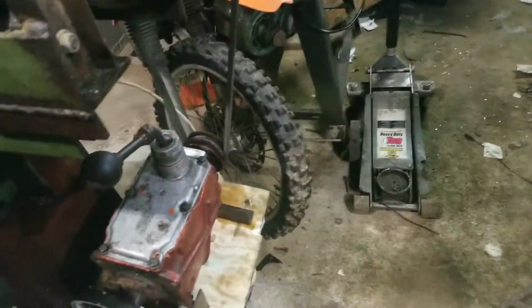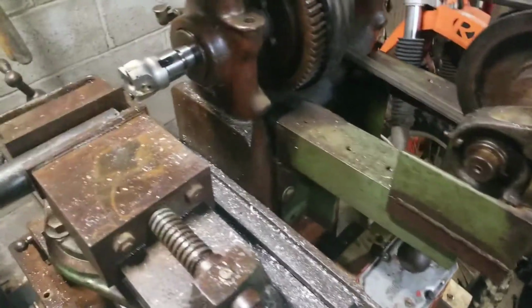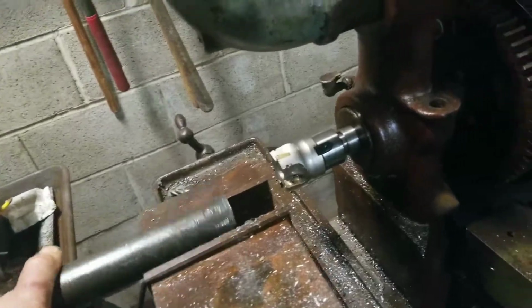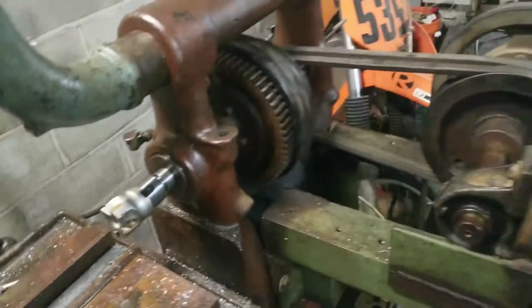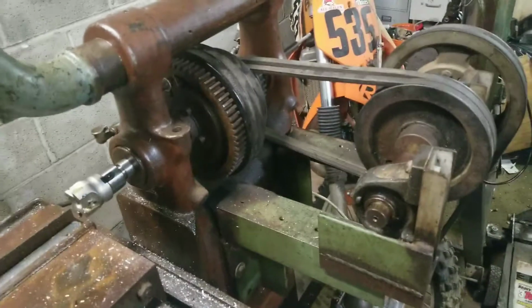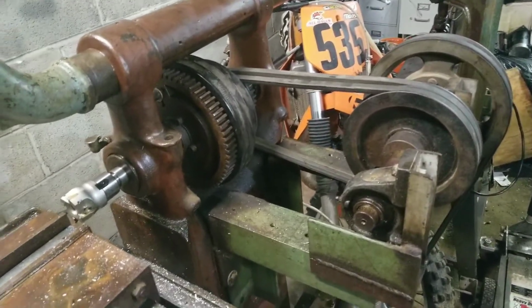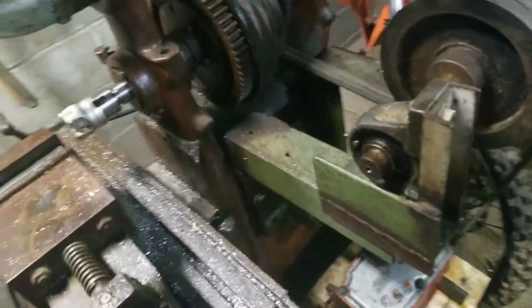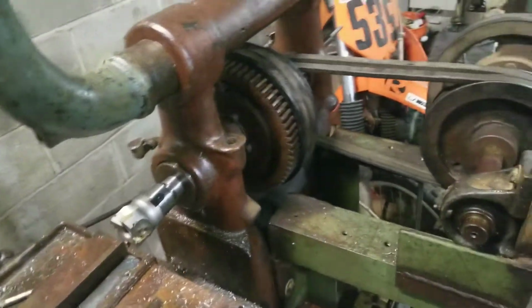And I just made it way more rigid, and I just tested it out and took 200 thou off this 1 3/4 inch with the face mill, and I can't do that with my little import vertical mill. It's a Jet 15, but that would be a joke trying to do that with that. So I'm super happy that this has worked out.